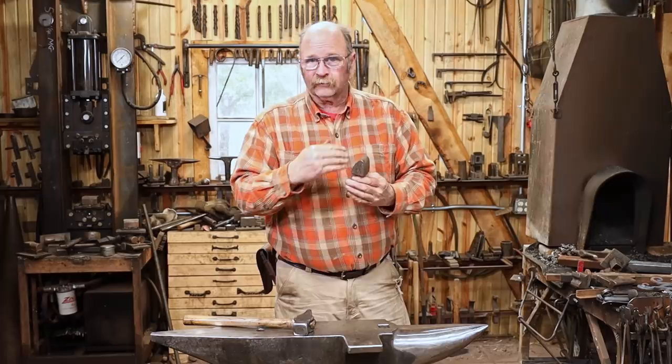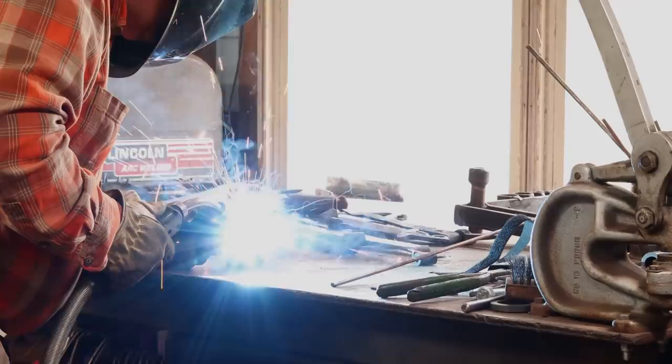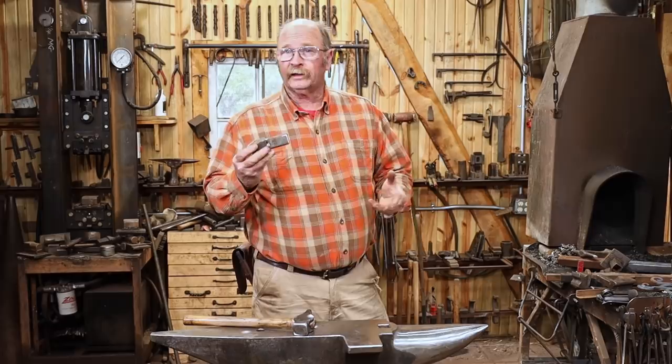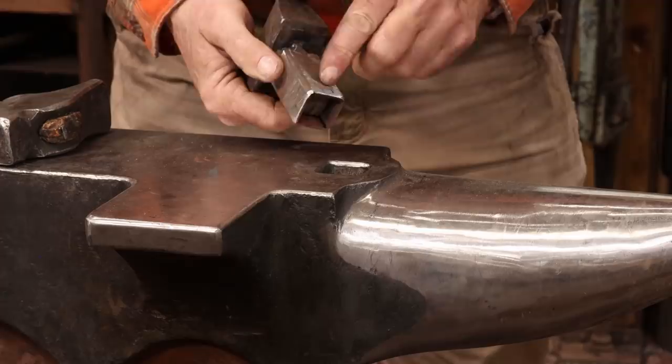When you weld around there, the weld bead is often in the way of fitting tight down to the anvil, so it frequently needs to be ground clean and flush. I'm going to put a quick weld in there — it doesn't need to be anything high strength. All you're doing is holding a spacer onto this. It would probably stay just driven in, but I'd rather be sure the thing doesn't fall off and get separated. Now we're right back to where we were — a slightly oversized hardy shank because the tubing is a little bit big, but not by much. You can see scratches down here; the top looks pretty good, so it's just that lower part of the hardy hole that tends to be the hang-up.